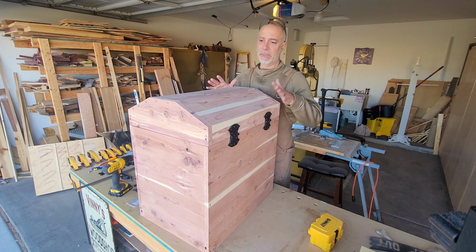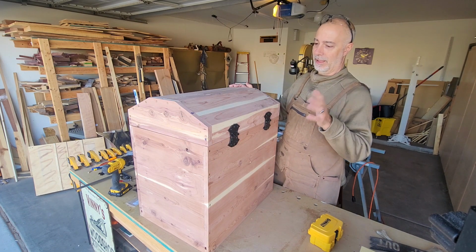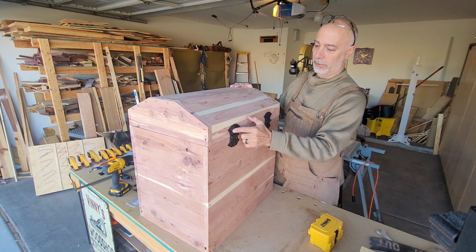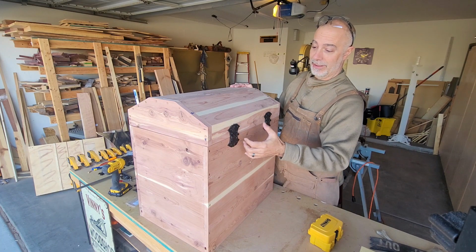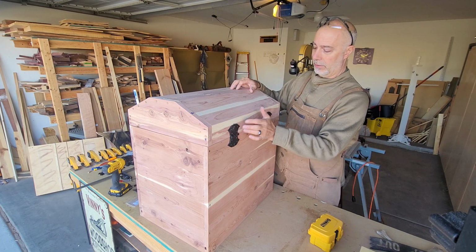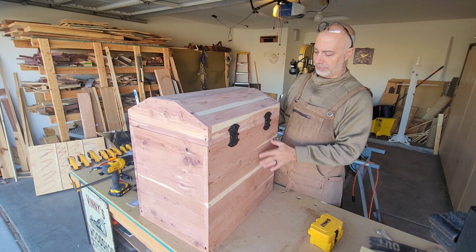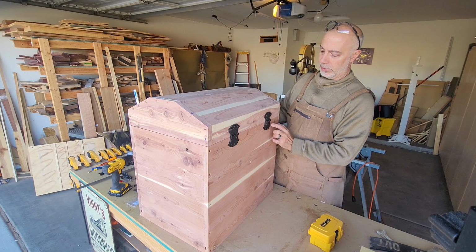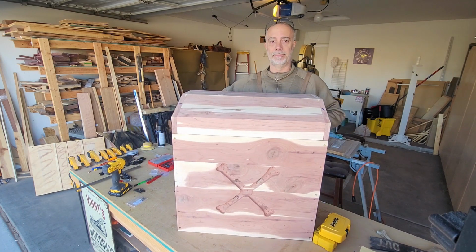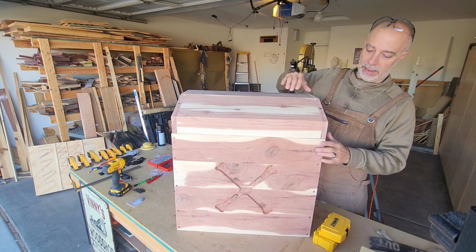Slight modification to the plan. You don't need to make sure that this is perfectly aligned at the very beginning. It's just going to mess you up. You're going to be trying to correct it all the time. So just go ahead and secure the top portions of these first. Make sure that they're definitely straight, because if they're crooked, it's not going to open and close right either. So put these top ones on first, secure those. Once those are secured, then go ahead and line the top exactly where you want it. Then lower the hinge down, mark the locations, punch them, drill them, secure them, and voila. So you see, it opens and closes very nicely, stays aligned, that's good.